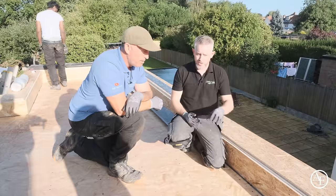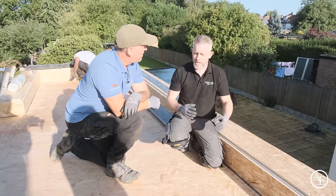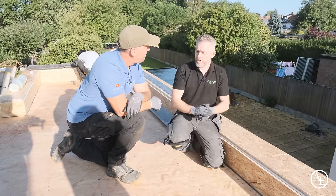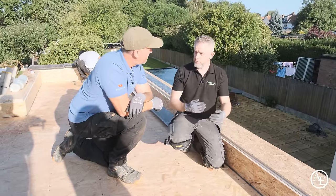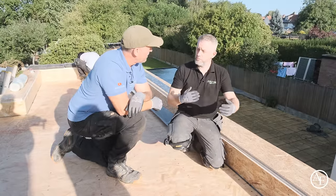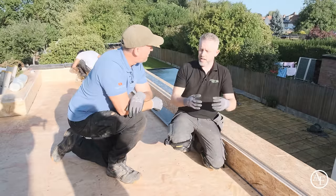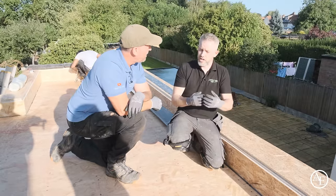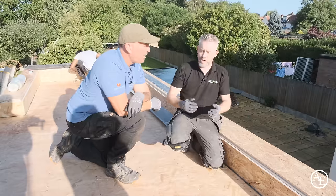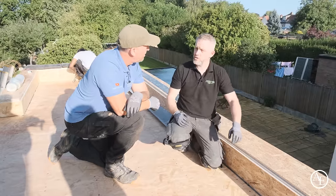Yeah, okay. And it's normally regarding the boards upwards, and then obviously the mixing of the system, but we can go into that later anyway. But regarding the actual boarding, if you're boarding solid and you've got enough expansion, even if you use an 8x4 sheet, you've got minimum 3mm gaps in between. It just allows for the roof to move and contract, because obviously you're going to be putting a dark colour on the roof, and it's a natural product, so it's going to draw heat. So naturally it's going to expand in the morning and contract as it cools down of an evening. If you didn't do that, you'd get the banging sound or potentially ruptures down the actual board lines.